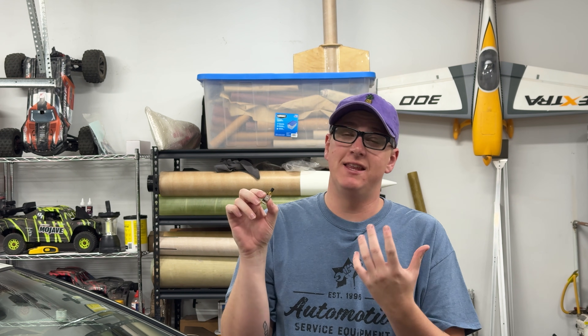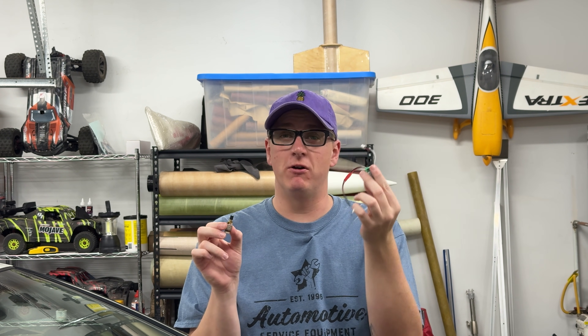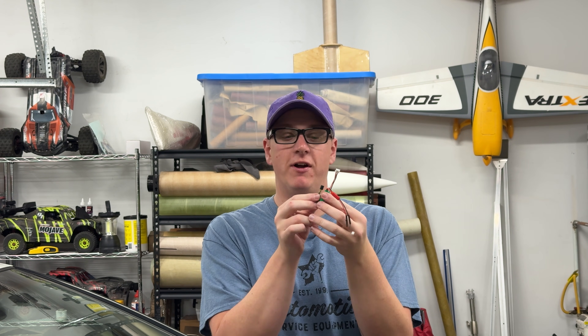A cool feature is that the input voltage is extremely forgiving and variable — it can run anything from 3.2 volts, or a 1S LiPo, all the way up to 16 volts. So if you really want incredible runtime and put it on a 4S battery, you can. Here's the battery I used — a 180 milliamp hour 2S pack, which is a pretty small battery, but funny enough, it's bigger than the actual GPS transmitter itself and weighs a lot more.